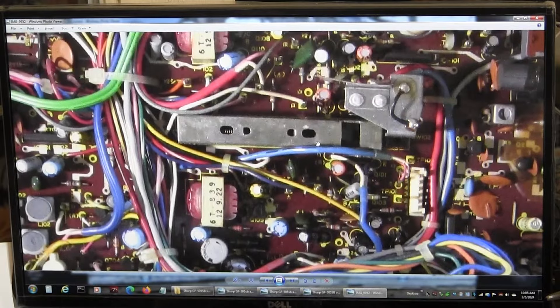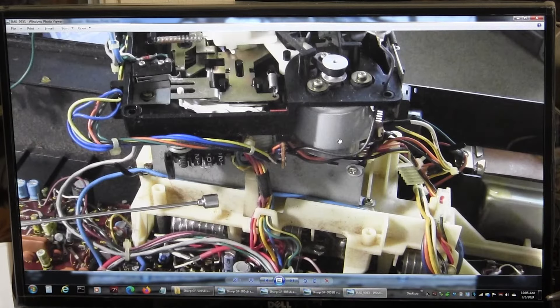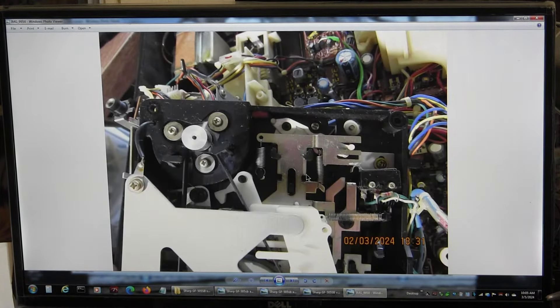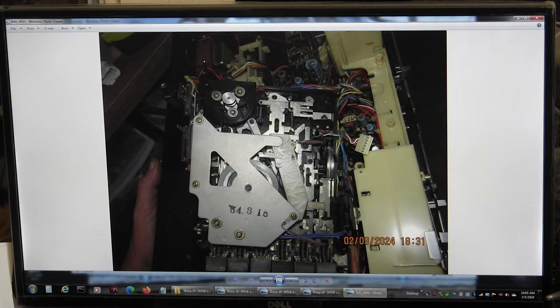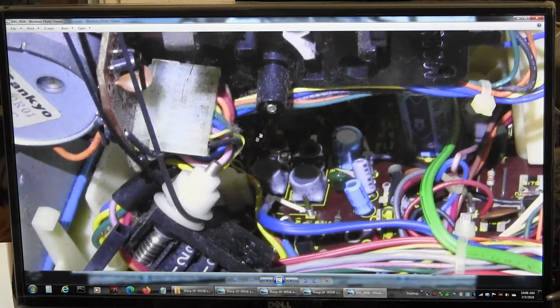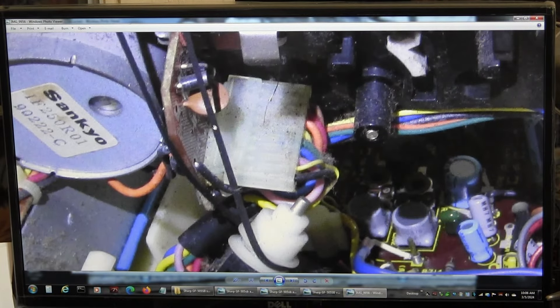I guess this is the recording bar switch. Here's a picture of the tape counter still in place. Here I need to know that's where the tape counter wheel is, and here's the one screw that holds it in place — it's a sheet metal screw. We're just holding the tape jack here. We have removed the tape counter so we can unplug this plug from that circuit board.